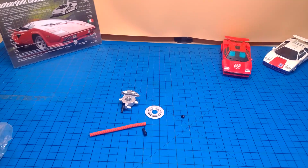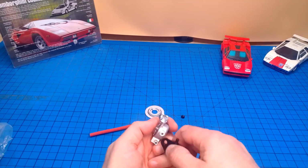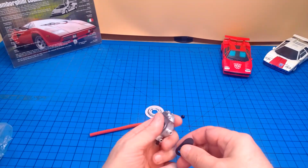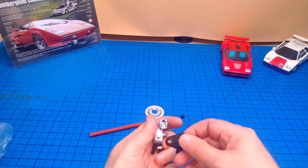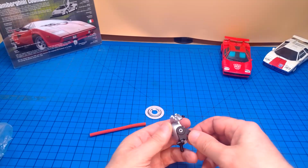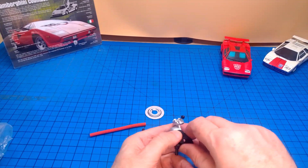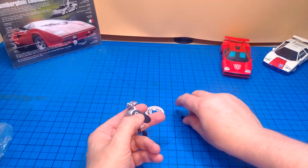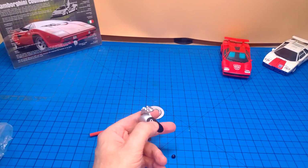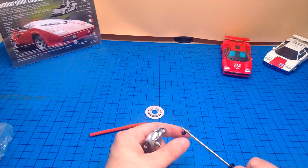Okay, let's get started. Now what we need is, apart from stage 32, this piece. And what we need to do is put it in here, which it will be going this way around here. Oops. Like that on here. So it still spins around. Make sure the L is facing that way. And then we get the screw, which is 2.3 times 6 mil screw. They're the flange screws. Now we are going into metal, so don't forget to dip.